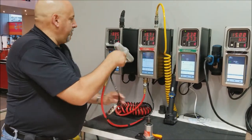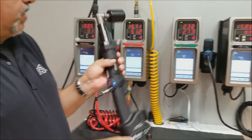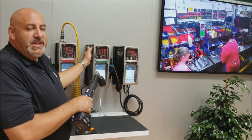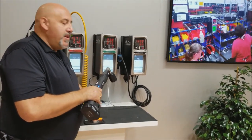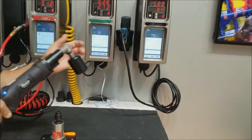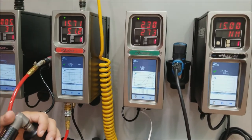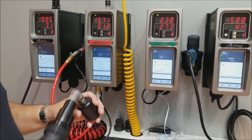Moving along, we have the cordless tool — the IAC — which transmits its information wirelessly through Wi-Fi to the IBC, or battery control. For this demonstration we have a Wi-Fi router: the tool speaks to the router, which speaks to the controller, and the information can then be sent to your plant networks. Normally in most plant environments you will connect the IBC directly to existing Wi-Fi access points in the factory, and that network receives the data and sends it to the quality server.